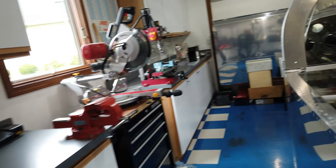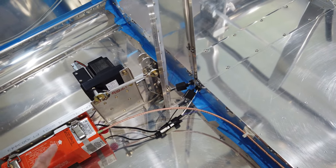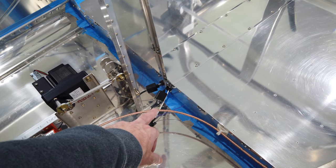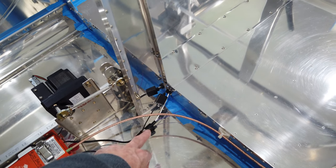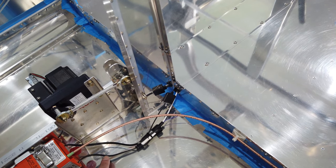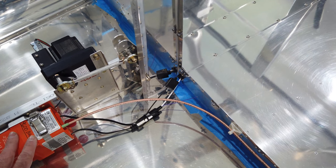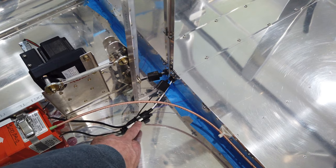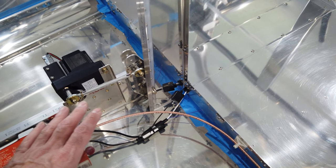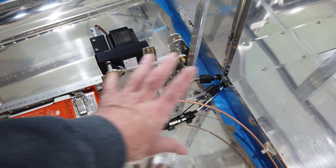Let me go around to the other side again. I also got an order of aircraft wire, and that included some shielded wire. So now I have also finished the wire bundles, if you will, for the ELT. So I got my three conductor shielded white cable that you can see here. And I went ahead and fabricated that line, which connects to the ELT, which will ultimately provide GPS data to the ELT. If it ever activates, it will give GPS coordinates. So I made up that line, which was the thing that I had been waiting for back here. So with that, I was able to make my connections back here and finalize these runs.